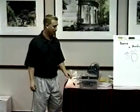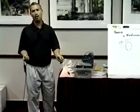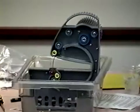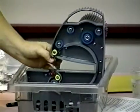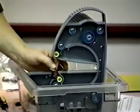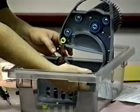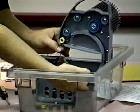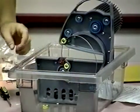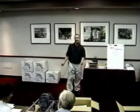You guys have to zero in on this because I'm not going to be able to hold it and show you. I'm going to remove the blade now. We're talking about always keeping rotation in mind. You can't just yank the blade off — you want to rotate the blade off. We're going to start pulling down in the same rotation that the blade makes, then take a hand and feel the blade on the bottom of the raceway, start to pull on that while pulling down, and pull until that blade pops out.